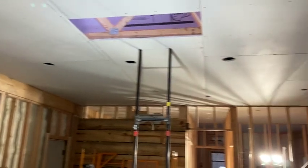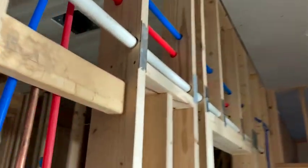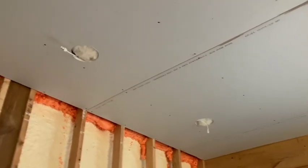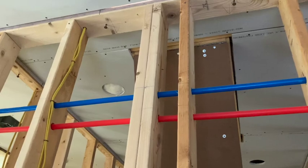Check this out. Is this great or what? We are making progress. I gotta do some work up there. I gotta trim out the drywall around the skylight opening, and then I have to add drywall in there, but that's stuff I can do myself. So if we walk back here, you'll see every bit of that drywall is on the ceilings. So we got the holes cut in the ceiling, all of these 6-inch holes for the can lights. They're not really can lights, but they look like can lights from the bottom. So I have to cover all of those holes from the attic side with fiberglass insulation before we do the blow-in insulation. That way the blow-in insulation doesn't all go falling out those holes.